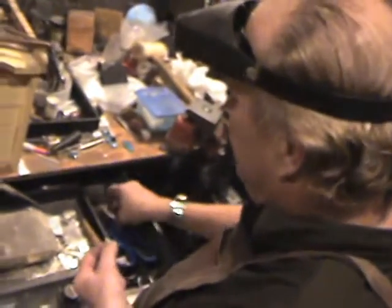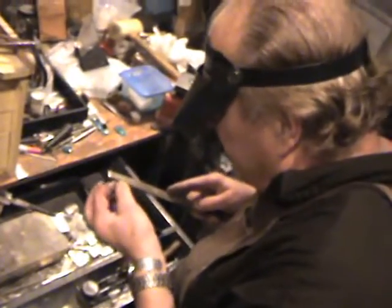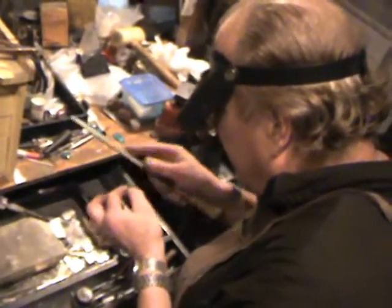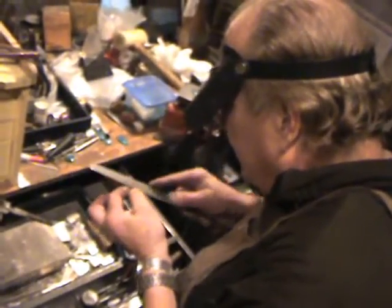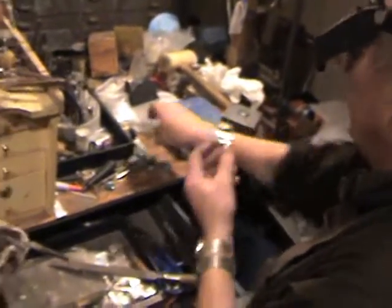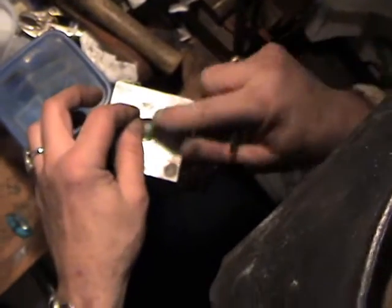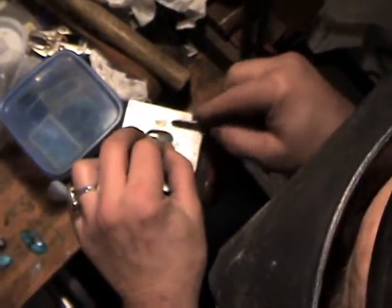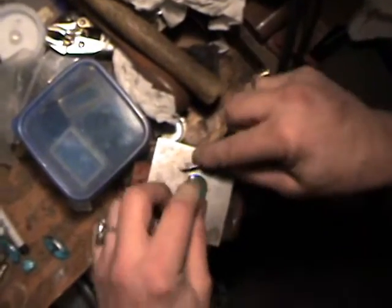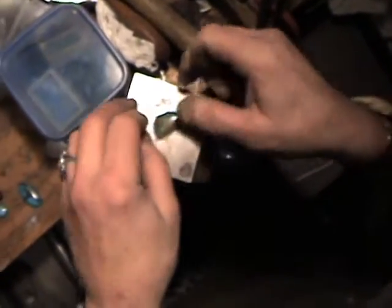Now with your finger holding underneath it, you're just going to take a little bit of that bezel seam out and file it a little bit to bring it down to make it even. You don't have to file it completely out just yet. Then place it over the stone, stretch it around the stone, and take the butt into your tweezers or something flat and run around the stone, conforming the bezel to the outside shape of the stone you're using.